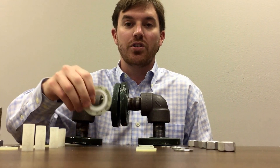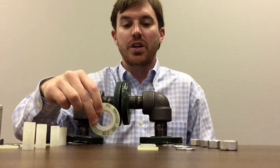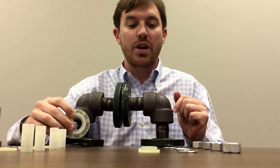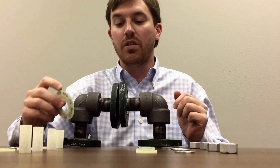We're going to install using G10 material on our sleeves and washers, and our washers will go on both sides of the flange, so that way we use what they call double washers or double insulating washers.